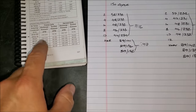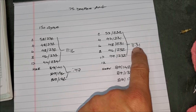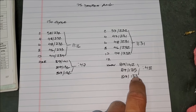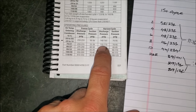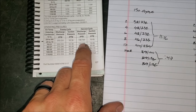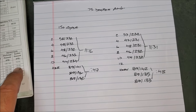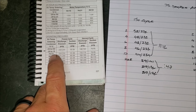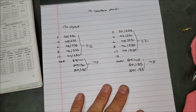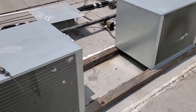So far we're looking pretty darn good. The machine is now making ice. Our cycles were a little bit longer after the thickness adjustment, but we're right on the money — less than 12 minutes for the freeze, less than a minute for the harvest. The only thing that's off is the harvest high side pressure. In the 70-degree range it says it should be 150 to 170, and we're 142 to 133. I've never — even on a brand new machine — seen the harvest high side pressure where it should be. Looking at suction pressure in the harvest: 89 PSI the entire way through. During the freeze cycle we're 250 to 235 and 55 to 38 — right on the money. This machine is working properly now.